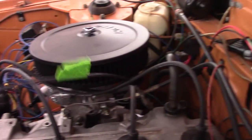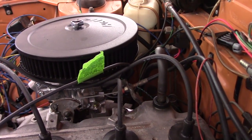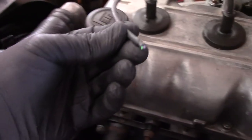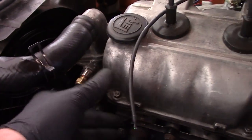Another speed bump on the road of custom cars - this is the engine coolant temperature sensor wire for the Holley Sniper EFI and it is just too short to reach our coolant temp sensor. So Kai is going to splice in some extra wire so it has plenty of room. He's over here making his own harness.